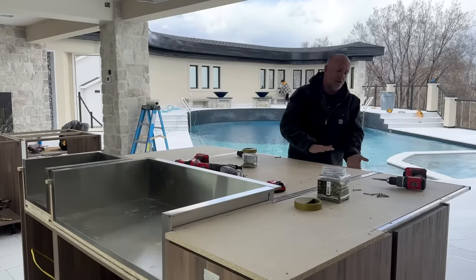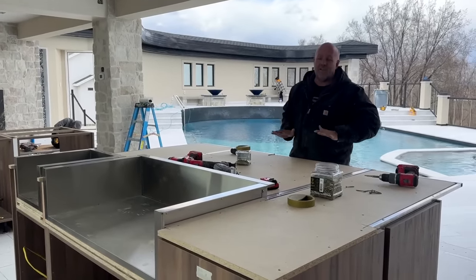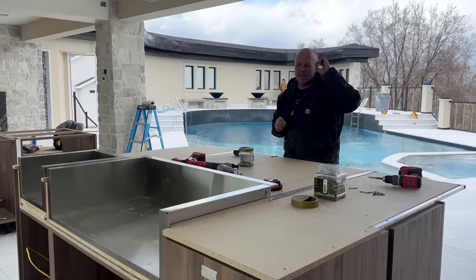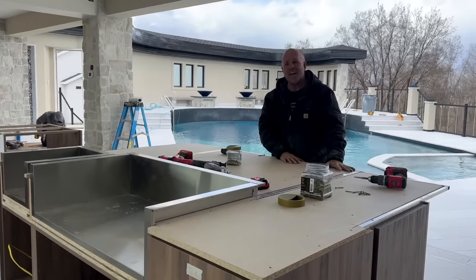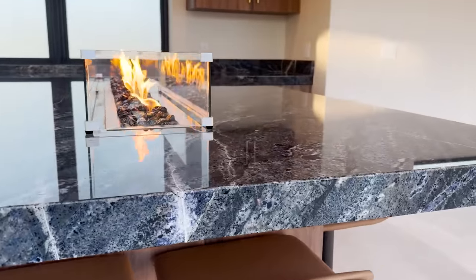And when that glue dries, coming out here between the overlap here and the steel frame, this is not going to flex at all. If you can't get it to flex, it's going to be such a minute amount, but then we'll glue down one piece giant granite slab on top of that, and if you bond them together really well, they'll act as one giant unit.